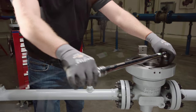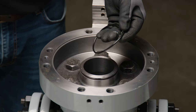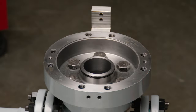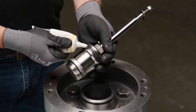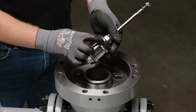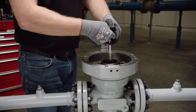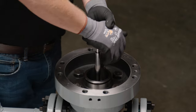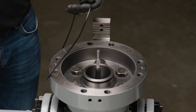Note that failure to tighten the bolts in the proper sequence may result in external or internal leaks. Apply a light coating of suitable O-ring lubricant to the adapter housing O-ring and install it on the adapter housing. Apply a suitable O-ring lubricant to the plug seals and install the plug assembly into the cage. The plug will stick slightly at the point where it transitions from the adapter housing to the cage; keep pushing with a slight circular motion to help the plug pass over the transition.